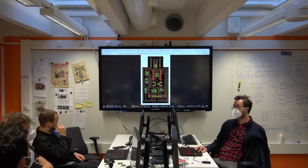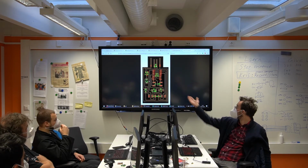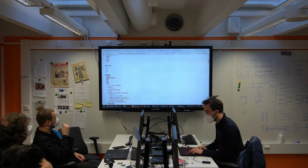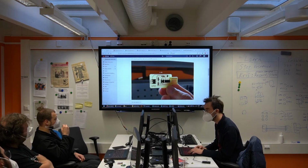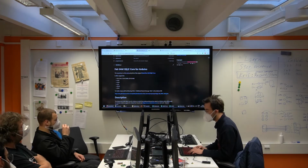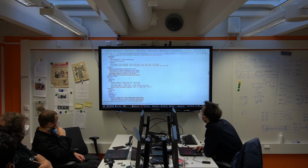Okay, can't we combine boards? What do you mean? All-in-one UPDI, FTDI. UPDI, FTDI? Oh, absolutely. Well, I mean, this is already a UPDI programmer if you just add the resistor. Right? Yeah. Neil has that. It's ready for you if you want. But the reason we made this project anyway is, well, there are 2 reasons. We wanted everything on one board, so it's, you know, just grab it and go for programming, and we have this nice symmetrical connector, so that was our reason. But you're very welcome to use Neil's version of that, which is this, if I'm not mistaken.